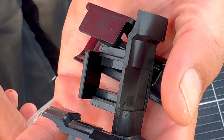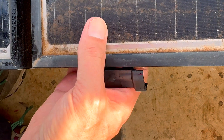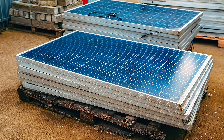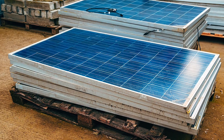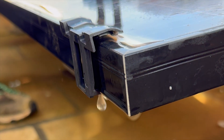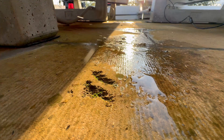One potential solution is to fit a solar panel drain — a small, low-cost clip made from UV-resistant plastic that attaches directly to the edge of the panel. These clips come in various sizes to suit different frame types, which is especially helpful for older installations with thicker frames. The drain serves two key functions: first, it breaks the surface tension of the water, and second, it provides a channel that allows the water to flow off the side of the panel more easily. Simple but surprisingly effective.